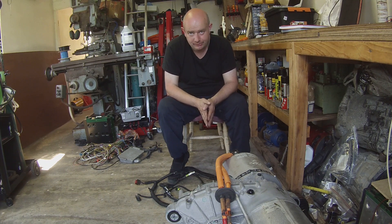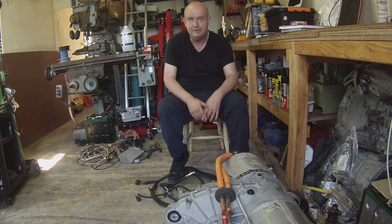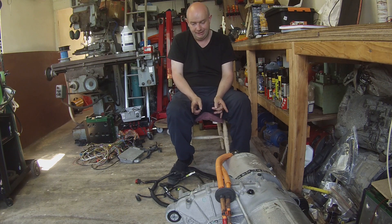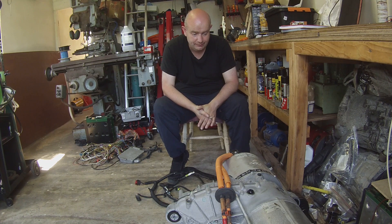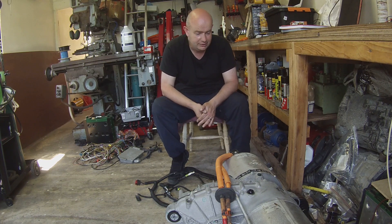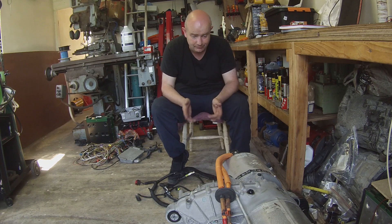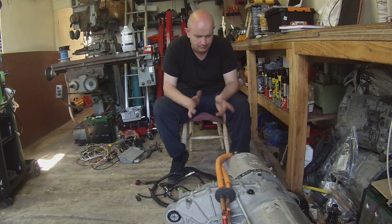There is very little public domain information available, but there is one document released by Jason Hughes that's quite useful — it lists quite a few of the CAN IDs on the powertrain CAN bus and what they actually mean and how to interpret them. I'll be using that to see if I'm in the ballpark. For example, there is one message that tells you whether the inverter is in a fault state or in drive, reverse, or park, so at least I should be able to interpret some of the messages coming back and see if it's even trying to go into operational mode.